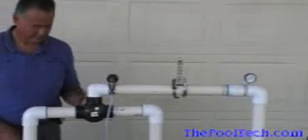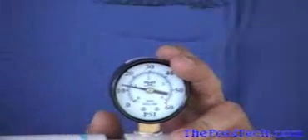Okay, let's see what the new variable frequency drive pump is going to do without any performance loss, pumping the same 80 gallons per minute. We've got about 12 to 13 PSI — it's going to be the same. Now, how much electricity are we drawing without sacrificing anything? 1.66 — 1,660 watts. So we're saving 340 watts just because this motor is more efficient.